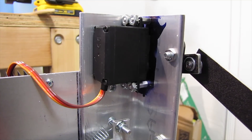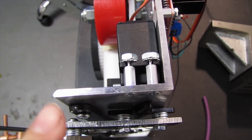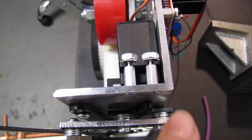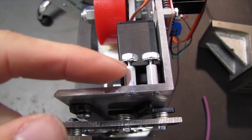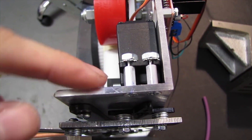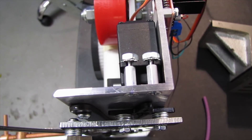The servo is mounted from the rear on this piece of 2-inch by 2-inch angle aluminum. This was originally a little bit curved because of the way the extrusion happened — you can see these edges are curved too. But I needed this servo mounted tight to the corner, so I threw this in the milling machine and made a nice square corner. There are some number 6 hex standoffs at the perfect length to mount the servo so that its shaft just poked through the aluminum, then mounted with number 6 nuts with integrated lock washers.